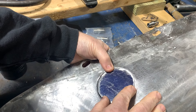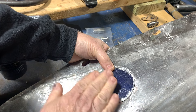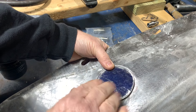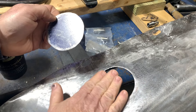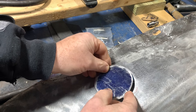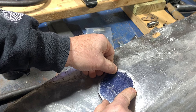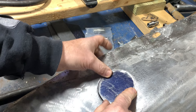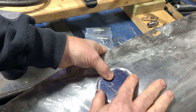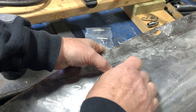There's the panel that we made. It's still just a little too tight and it needs a little bit of a contour put to it — it actually goes in just a little bit, and then from this end to this end it curves up a little bit. So before I take anything off of it and make it smaller, I want to make sure that I get those contours done. The reason it's oversized now is because once you start to do that contour, it's going to pull the edges out just a little bit.